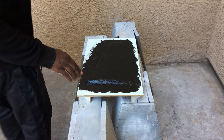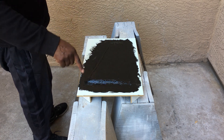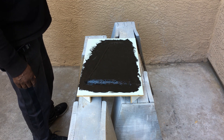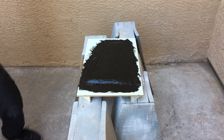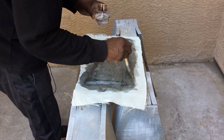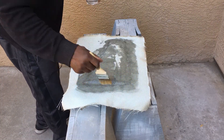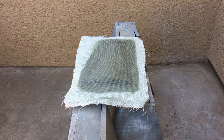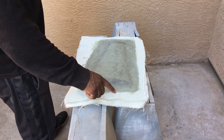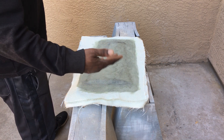Here it is with all the epoxy, cabosil, and graphite powder — pretty thick all around here. Now I'm going to start laying fiberglass down over this and putting the epoxy resin over it and building up a thick layer. Here we have half of the mold now complete. I've got three layers of 20-ounce fiberglass and resin over this, and when this dries I'll take the splitter plate off and do the repeat for the other side.